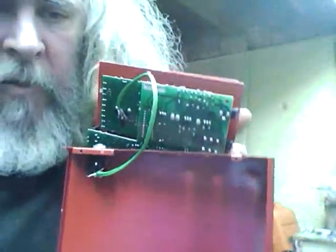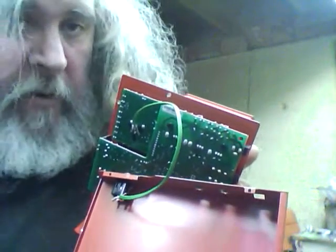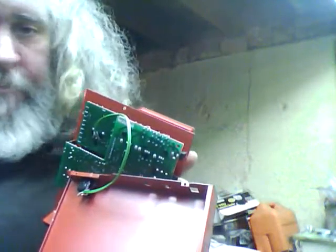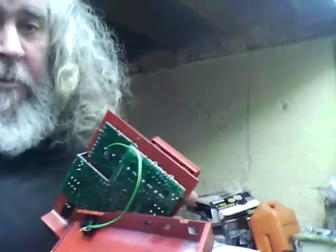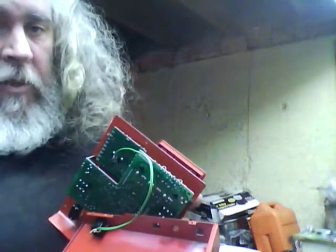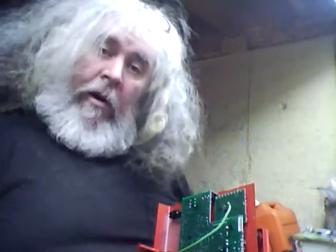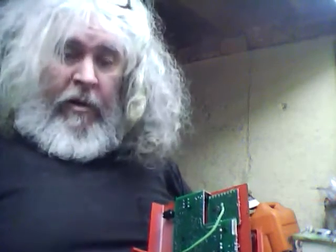It goes to a simple tip ring sleeve jack. Note that the ground is isolated on it from the chassis. Whether that's important or not, I don't know. I would imagine it is, because you're not actually dealing with the ground. We're exploiting a tip ring sleeve cable in this case, so that we can get the 3 connections that go to the encoders, so that we can make the Whammy presets go up and down, depending on how you push the buttons.